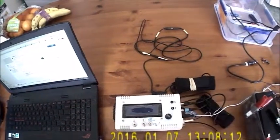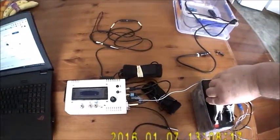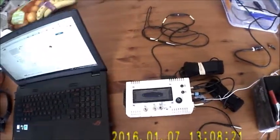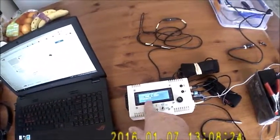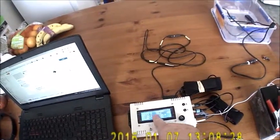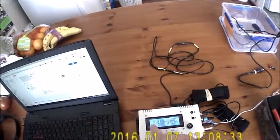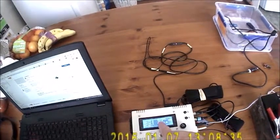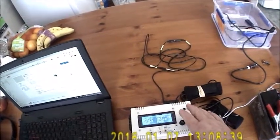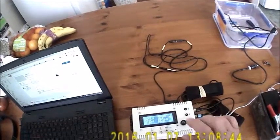So this can be operated in standalone mode, so connecting up the 12 volt supply like that and turning it on, you can see it's detected 2 probes, 2 temperature probes. It's giving the ambient temperature, the humidity. The display is in Celsius mode. The dew point, the tracking mode of this device. It has 3 different tracking modes: ambient, dew point, or midway between the 2.